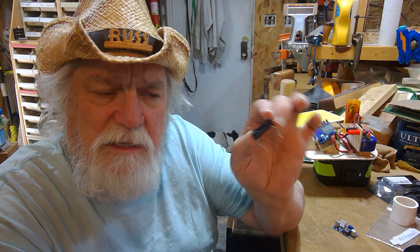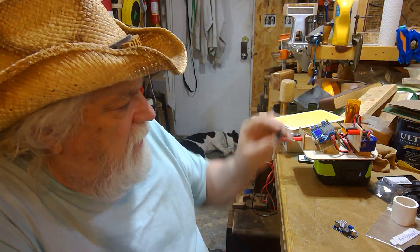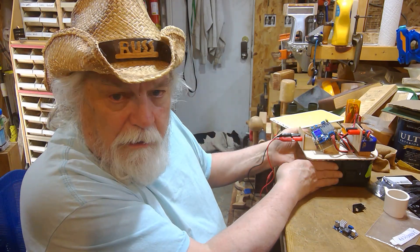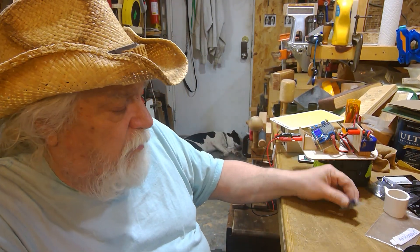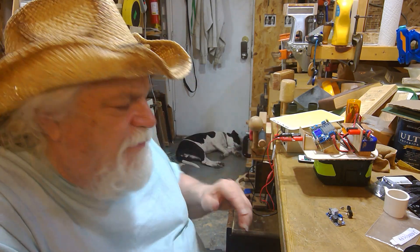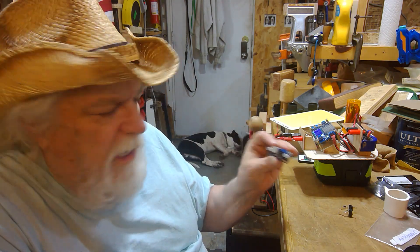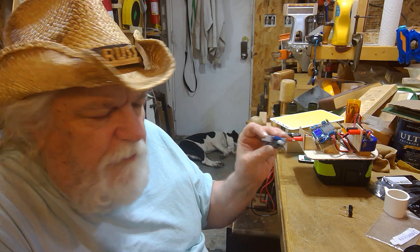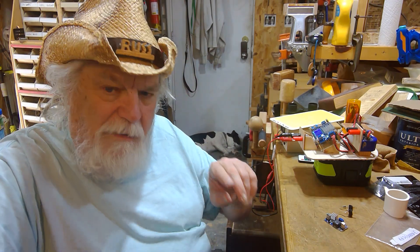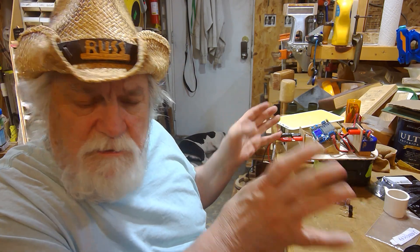The only other thing you really need is one of these — the little battery clip you can get from Ryobi. The part number is 300001044. It clips down on top of the battery, and you've seen me make receptacles before — we're going to make a receptacle on a box to drop down onto a battery. As for a fuse: this buck converter is only about a dollar and a half, and worst case it would just overload and I'd replace it. I don't think I really need to fuse it, but if you want to discuss that, leave a comment.